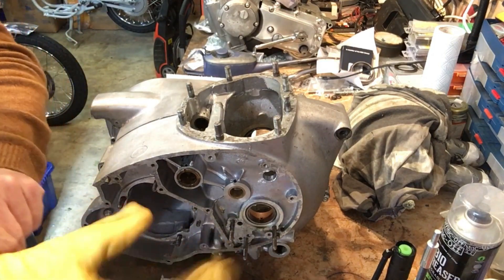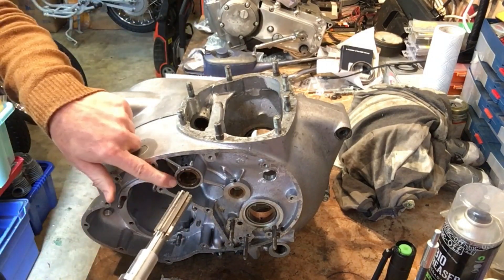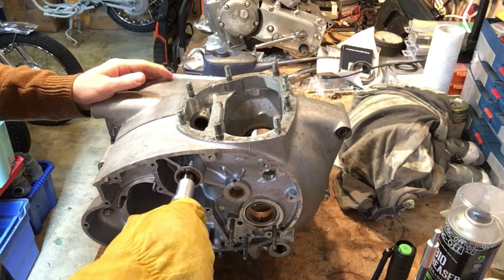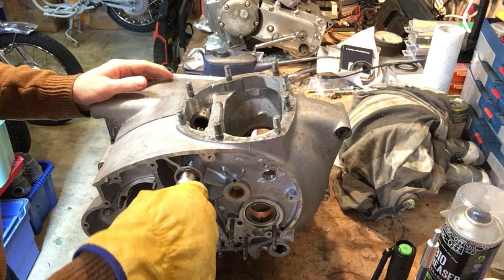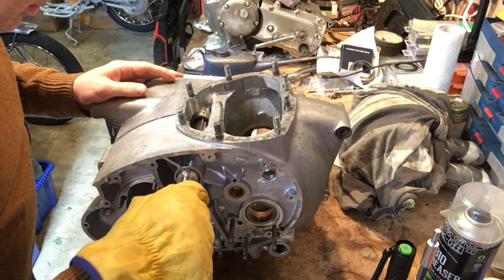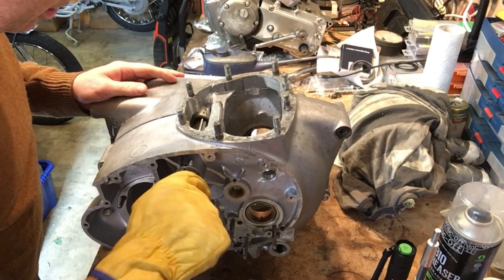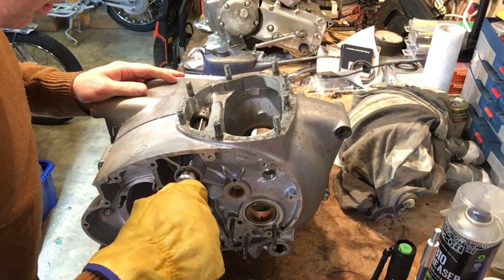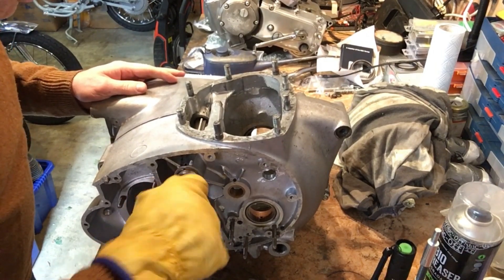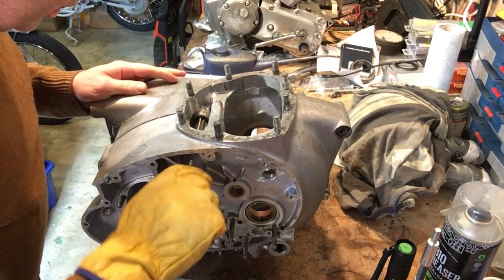Okay, let's get the reamer and its slider in from this side. As this bush is 7/8ths, the reamer itself will go through that. The slider goes into the 7/8th bush and it fits nice and tight. And then we can just begin to gently clean out that bush on the other end — and there's a little bit of work to do.